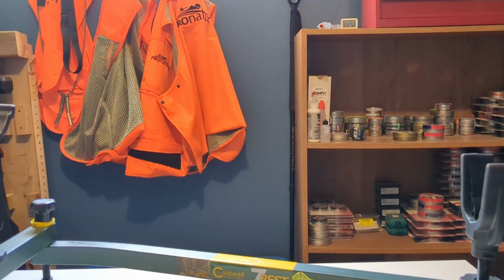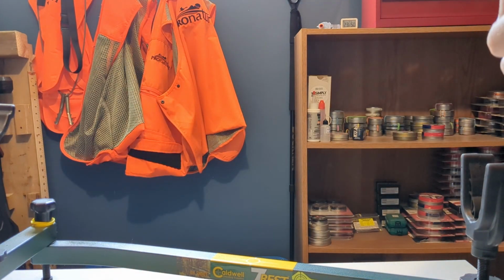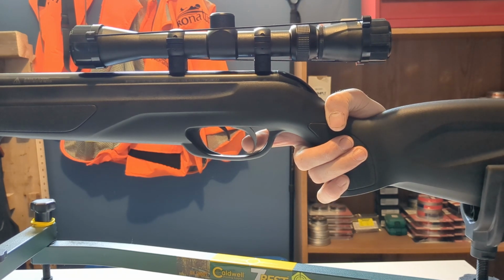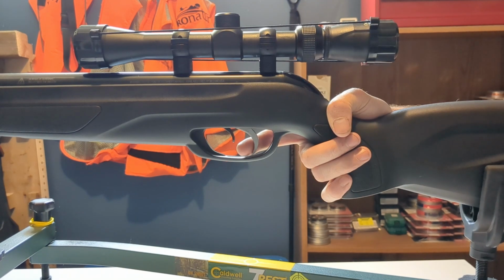In this episode we will talk about the Gamo Smooth Action Trigger, which is commonly found on middle range Gamo air rifles. Out of the box with the screw all the way in, you get a little bit of slop, then you hit a wall, but there is still a little bit of creep after that. Let's see that again to be able to compare.